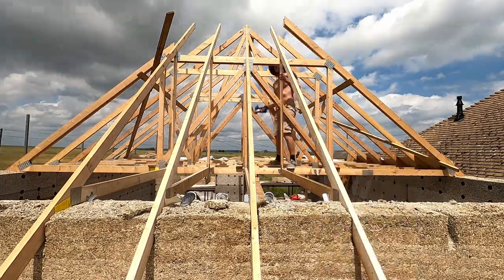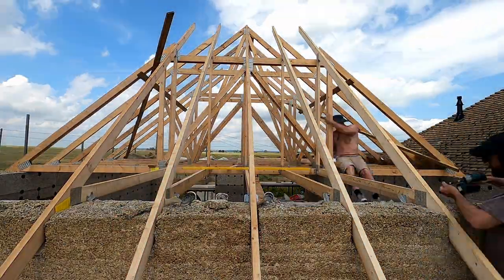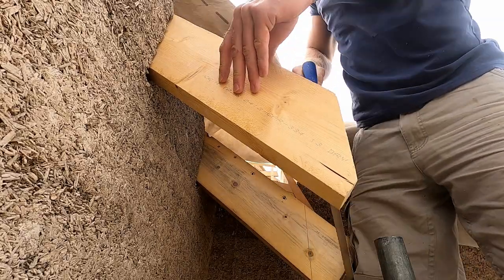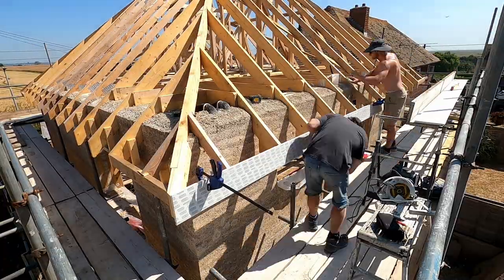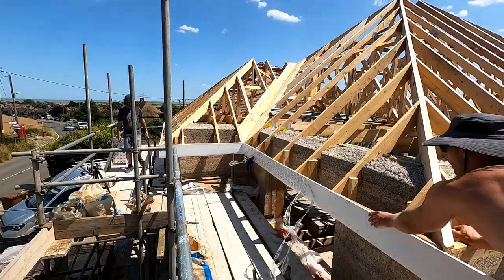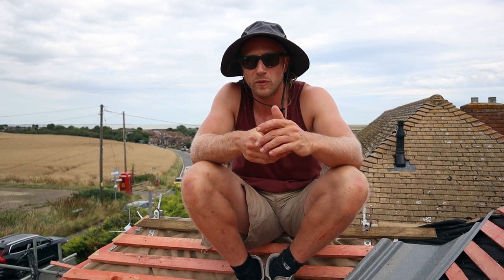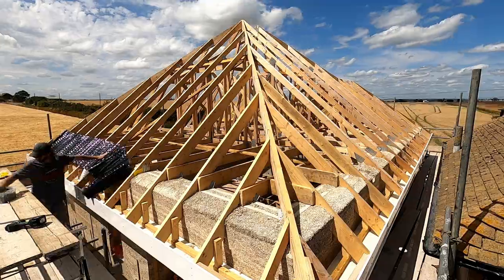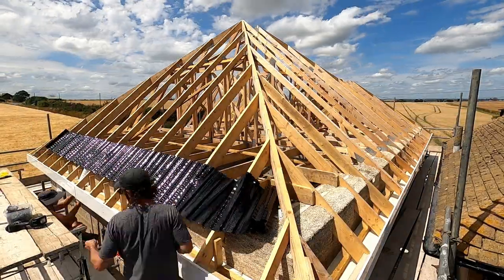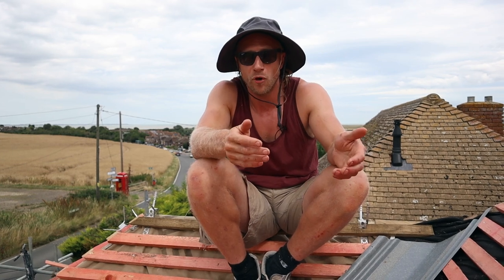We got the roof frame in, and then after that we went around and we chopped all of the rafter ends where we needed them to accommodate the fascia being fitted to, and we also added some additional timber work on the back for the soffit to be able to fit to. And the soffit we used was a vented soffit, which basically means it's got grooves cut out of it to allow airflow to come from the outside up into the soffit space. And then the idea is it travels from the soffit space into the loft and it prevents dry rot.